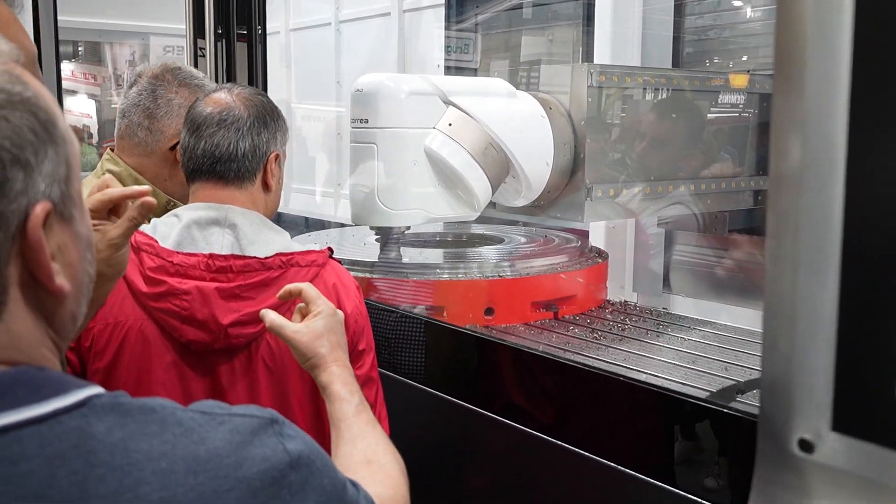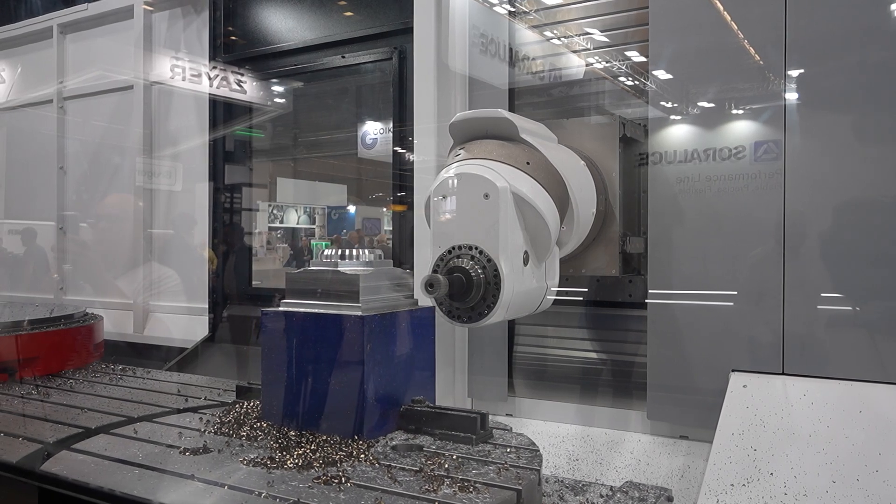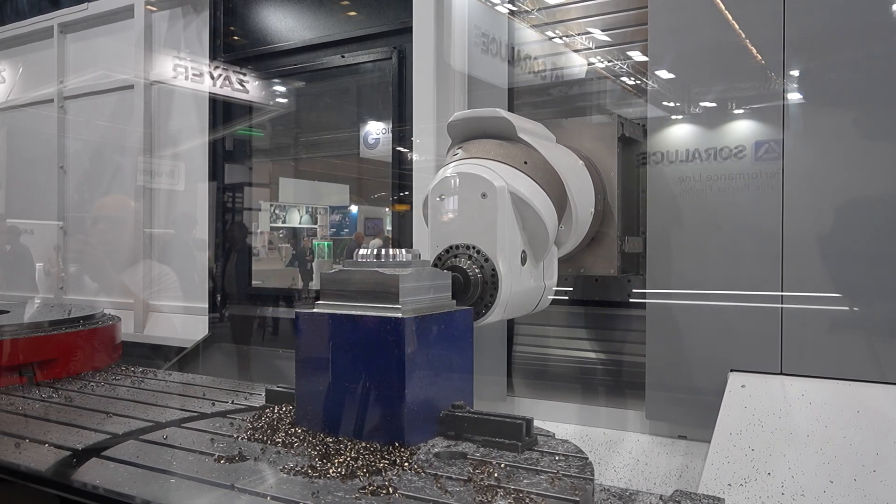And how do you get that support so it is so true wherever it's machining? We always use mechanical systems to compensate the angular errors — the normal angular errors that all machines have. In this case, we have two steel bars going through the ram. We tighten those bars, put an electronic level, and then we ensure that the ram in its movement is going perfectly straight with no angular error.